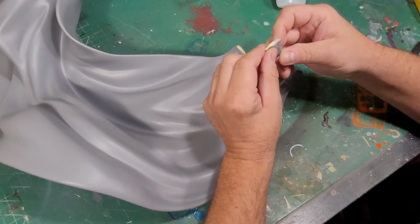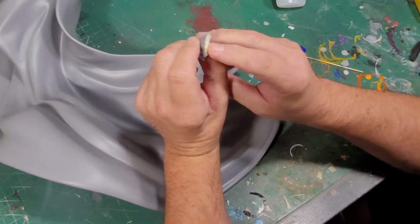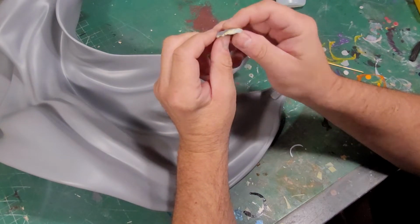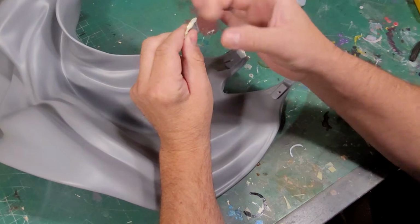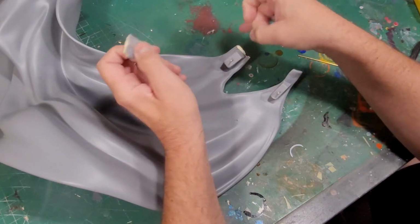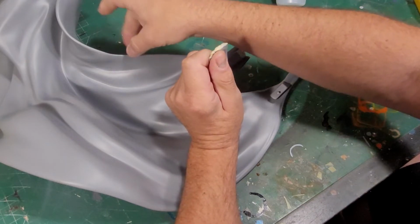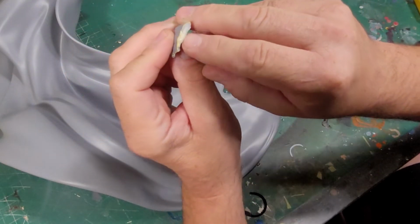Now I'm looking at the cross section here, and it looks like this may have broken at the factory and they fixed it. And the reason I'm saying that, because we have the color of the resin here, which, by the way, these factories tend to use a cheaper resin. It's very brittle. It doesn't have any flex in it, and you can tell. Like this resin has like a shiny cross section.